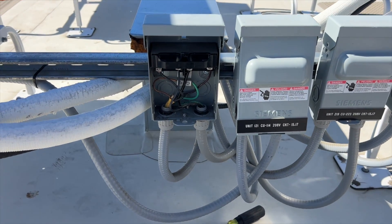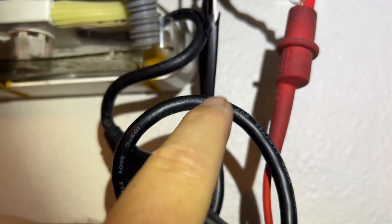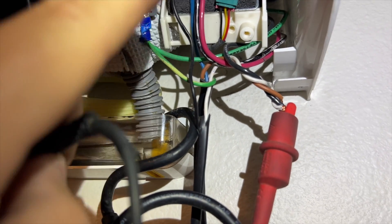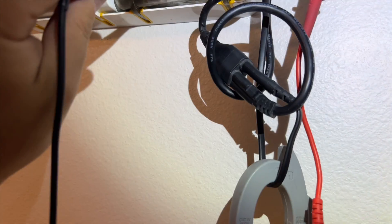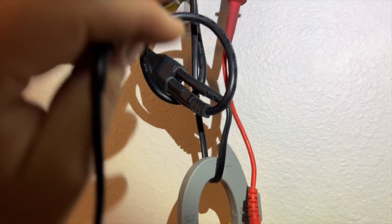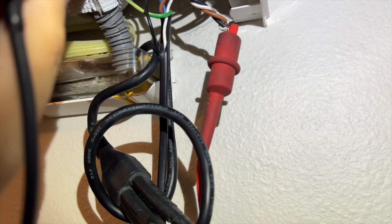There might be an issue with the pump — something with the overflow switch. This wire nut here is line one. You have two connections: one is power line one for the pump, the other is line one through the overflow switch back into line one on the head. Checking from here we've lost a leg — line one. But checking line one to line two, we have voltage, which means the pump isn't passing the signal through for some reason, even though it's not showing an alarm.